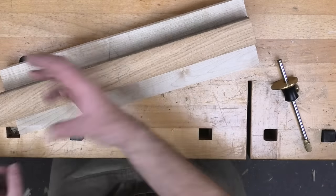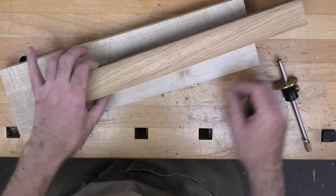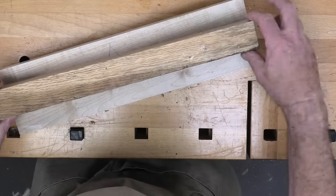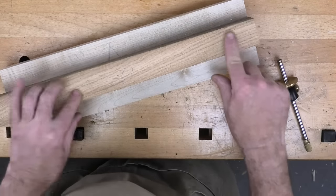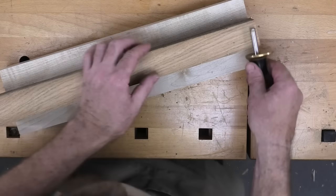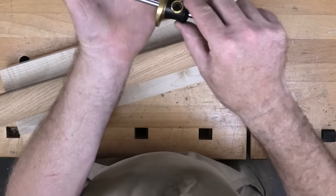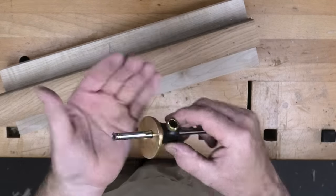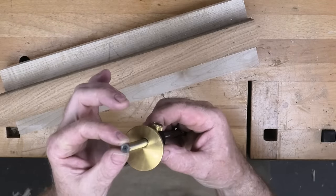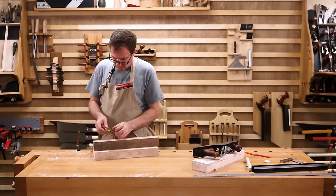We're just looking at now, even with my fingers here, I come up, this is thicker, thinner down here. Other side, that's thicker again. So my finished section width wise is there. So I've got a cutting gauge. Okay, so different types. This is a wheel one, so this has a little round wheel on here and there. We're going to come along. All right, so we can mark along with this.